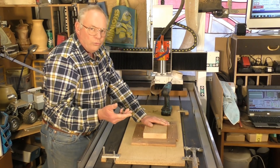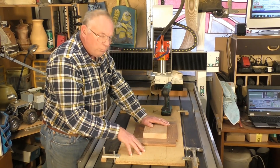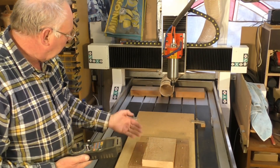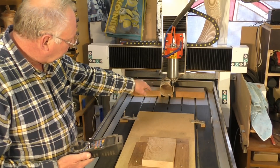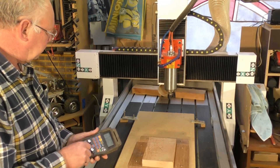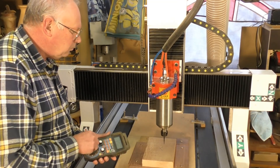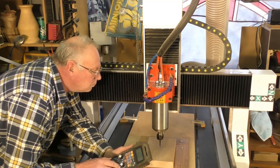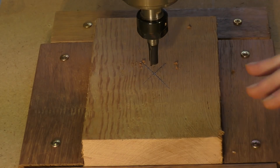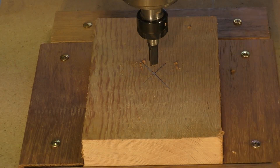This is one method I've used, and I do notice in the comments people asking how I've got this attached to my waste board — well, this is the trick. I've marked the center of the material with an X. I'm just going to bring up the router head or the spindle — I've got a nice pointy tool in there — and we'll set the X, Y, zero. Looks pretty good. I've set it all ready to go, so it's just a matter of pushing the go button and we'll cut this.